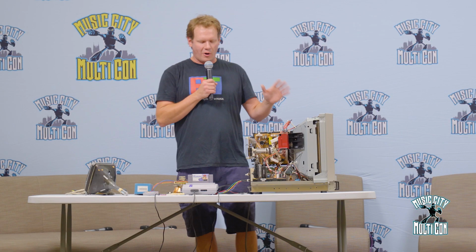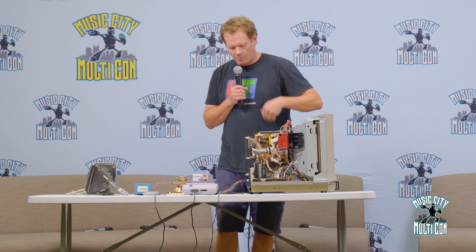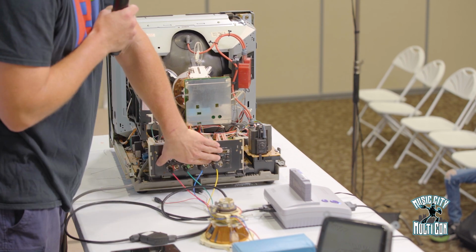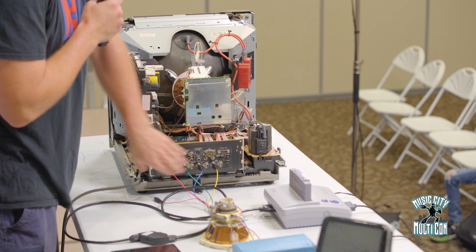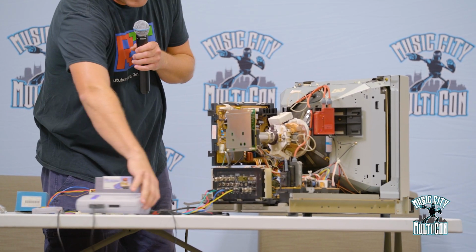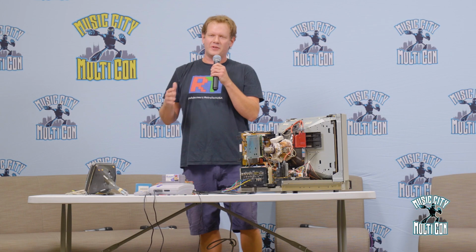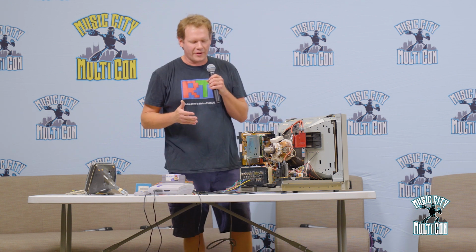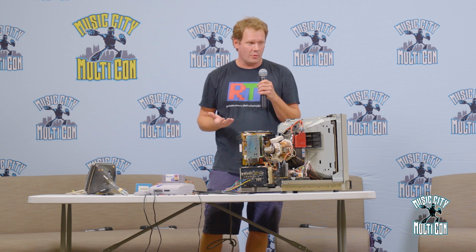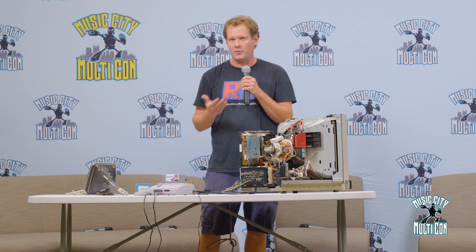And then there are other parts to this individual CRT that make it function. We've got our main board at the bottom, and then at the back here, our input board. You can see where we've got RGB into this particular monitor. Now, a standard CRT in North America will not support RGB. It'll normally support composite video or RF video, or if you have a better one, it might have S-video and then component inputs.